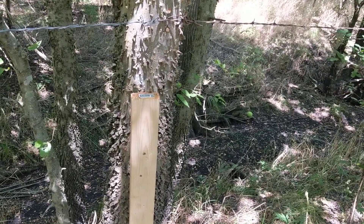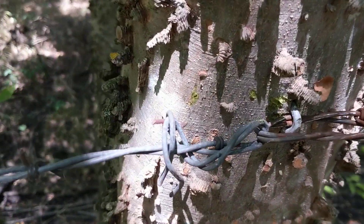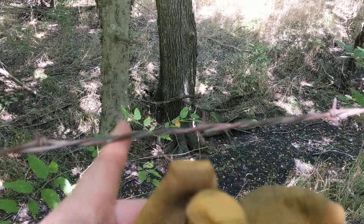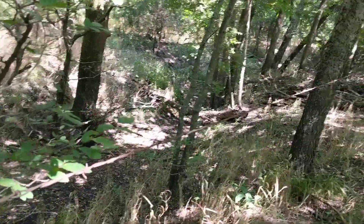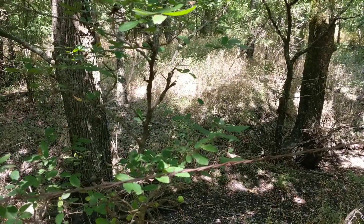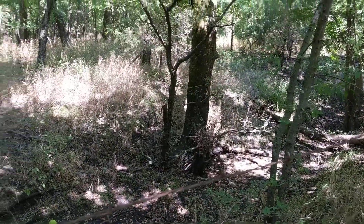I have an old fence here that's on the ground — four lines. The lines look fairly decent, although there are some patches here and there. This wire is also pretty tough. One little trick to know if a wire is going to endure a good pull: I get the fence pliers and cut it. If I struggle to cut it, I know it's good wire, just a little rusted on the surface. If it breaks really easily, it's a crappy wire and not worth pulling — it'll be more work in the long run.